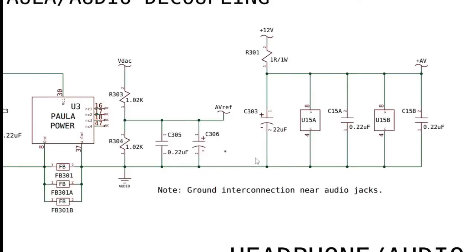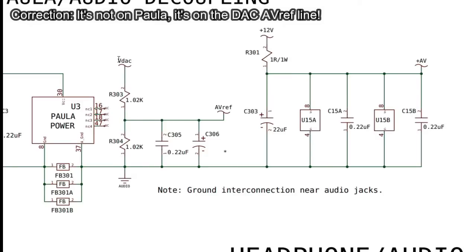Yeah, and I thought I'd just quickly show you the CD32 schematics there. So you can see at the bottom there's a cap with an X or something next to it, which kind of indicates they were going to stick it there, and then went, nah, we don't need that. Now it's important to note that sometimes capacitors can be removed for a reason. So it might be that you just got a little bit too much decoupling there, it's holding some power as the power goes off, and you've got a voltage mismatch somewhere where part of the circuit has got a little bit charged, still in a cap that you don't want.